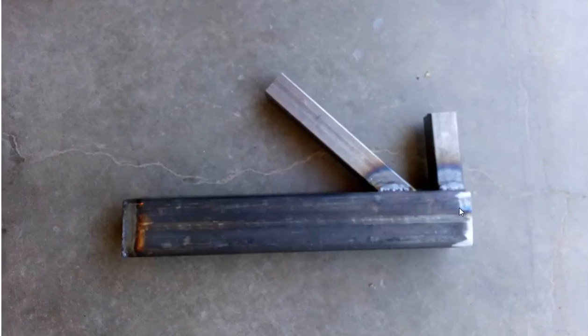Now this is all welded together, and I'm just getting ready to put on the bottom. I was going to put the mortar in, which I did, which was a bad idea because it's not a casting mortar. It was just a mortar that you use to cement insulating bricks together, and it's a high temperature, right? So this was actually quite difficult to weld in this area, very tight, and over here was very tight also.